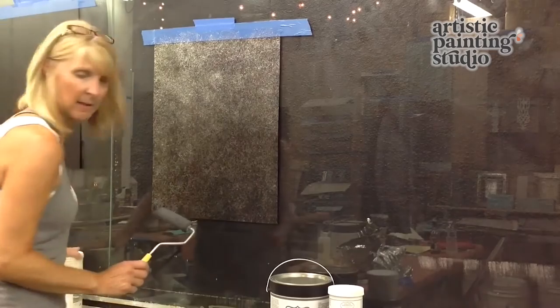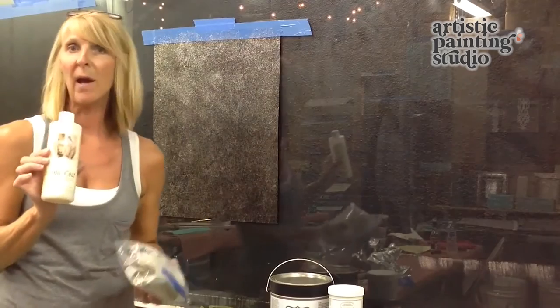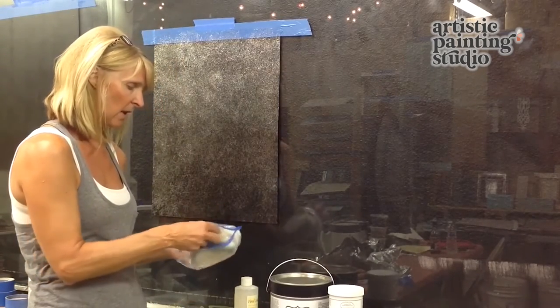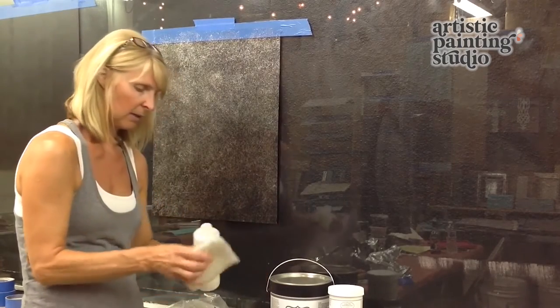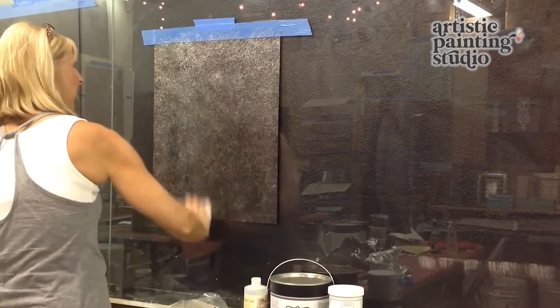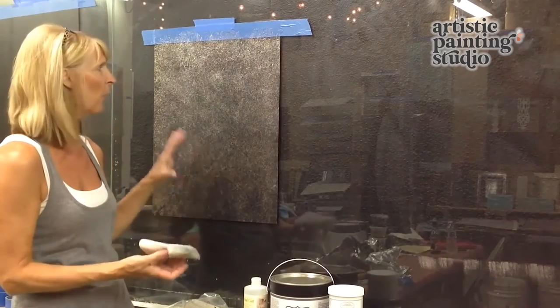Once you have transferred your foil you can go to the next layer — there's nothing else to wait for. I'm going to apply a coat of what's called Formal Coat, which is one of my favorite top coats — it's a water-based varnish. I keep my microfiber pads in a baggie, normally in the refrigerator or freezer. I tip the bottle a couple times to get fresh product, and then just wipe that onto the surface.